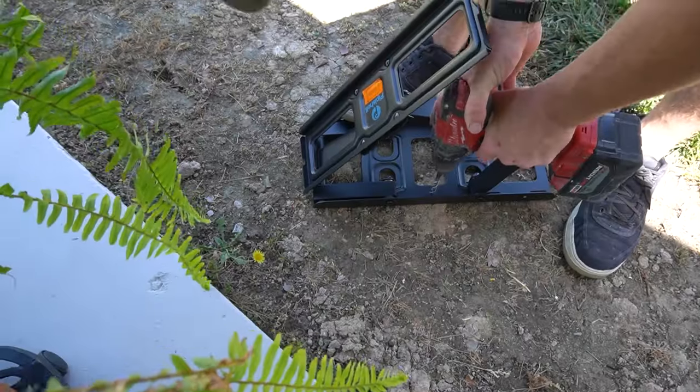That is a TV mount mounted to an external stucco wall. We did not have plywood behind it, so that made it a little more complicated. Now we'll work on the power outlet. We have the old-work outlet box with flippers to grab onto the stucco or drywall, a GFCI 20-amp outdoor waterproof power outlet, and an expandable cover plate — the kind that's in between the giant bubble and the flip-up style. It's waterproof and about $8 at Home Depot. All this stuff was about 30 bucks. We're using 12-2 Romex on a 20-amp fuse.